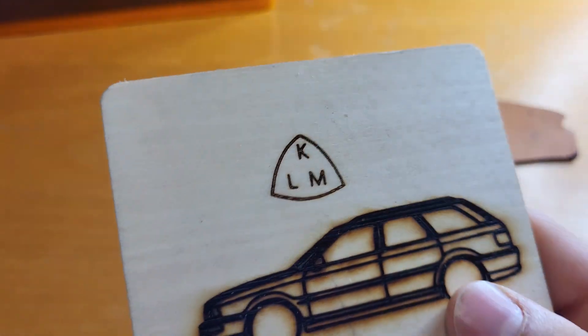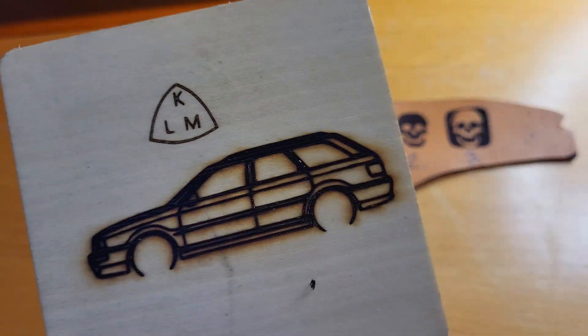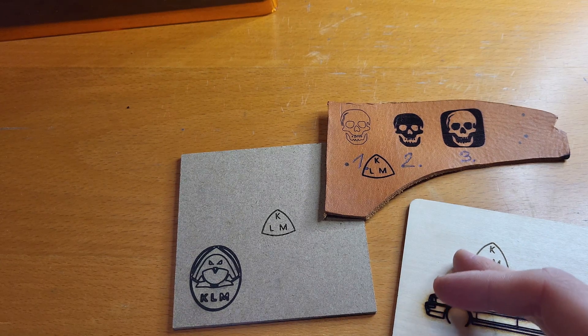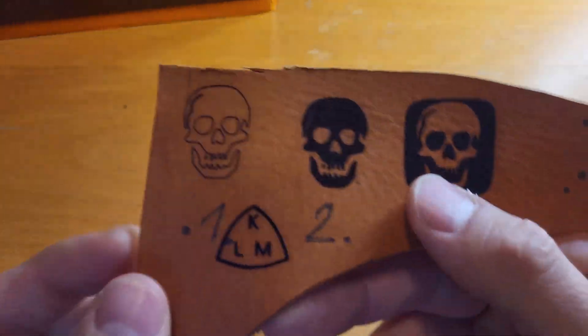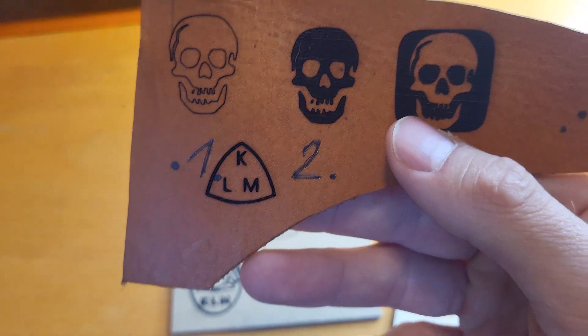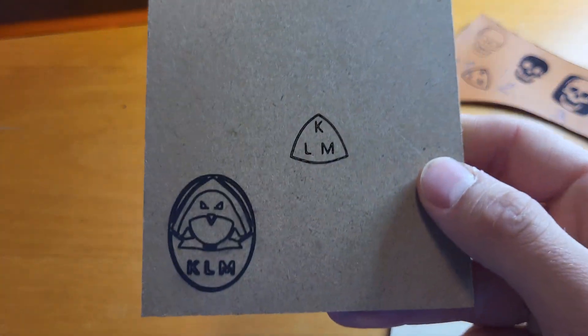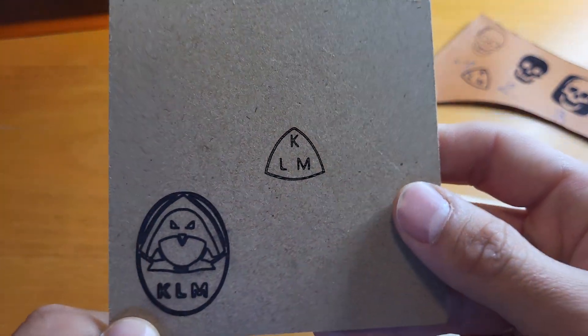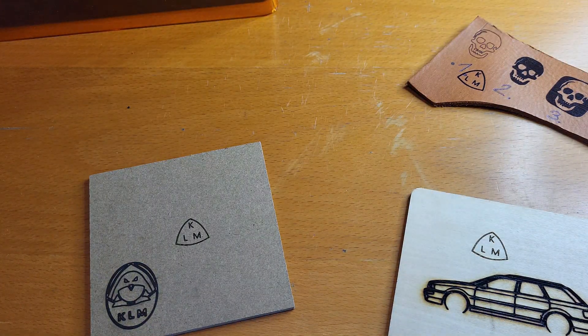Let's take a close-up shot of them. You can kinda see the infill lines, so you could take the laser a bit out of focus to get rid of that. You lose a bit of crispiness in detail, but you wouldn't see these infill lines as well. On the leather, that isn't necessary — leather is very forgiving for that, so the leather settings are absolutely perfect. And on the MDF, it's kinda similar to the balsa wood. Again, you can see the infill lines a bit, so if you bring it out of focus a tiny little bit, that would fix it.